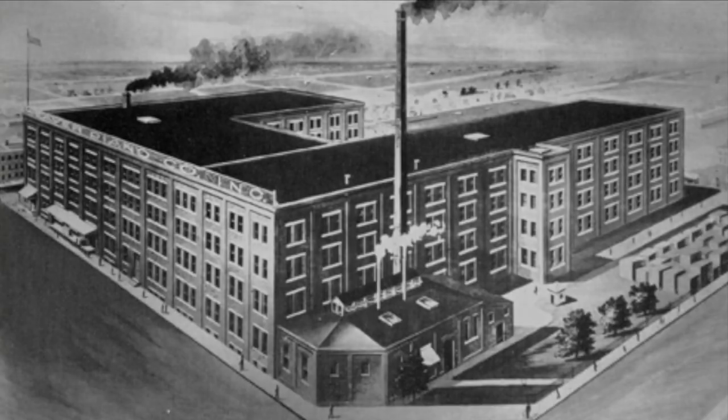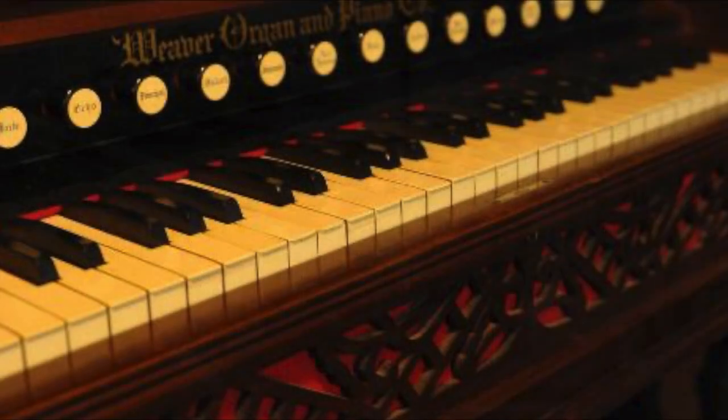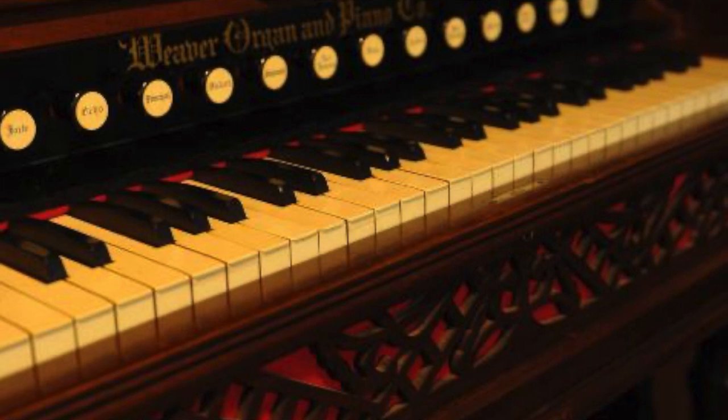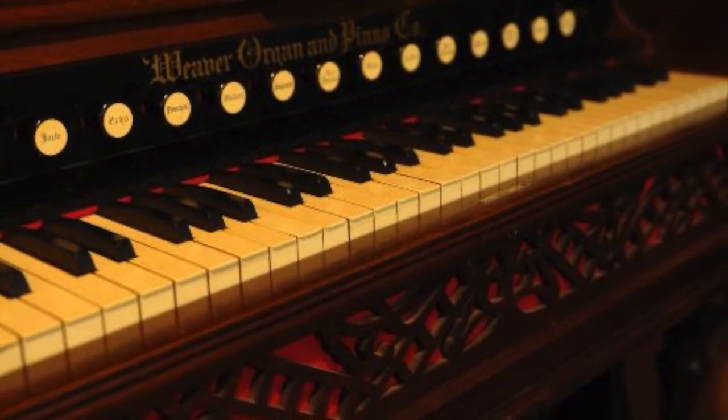When the pianos got into the field, because wood is porous, the grease and the lard seeped through the wood, and when it hit the pin area, the pins would no longer hold tight and the pianos would not stay in tune. At first, the pianos were returned to the factory where they were rebuilt. But so many pianos came back to the factory that they had to close the York line down.